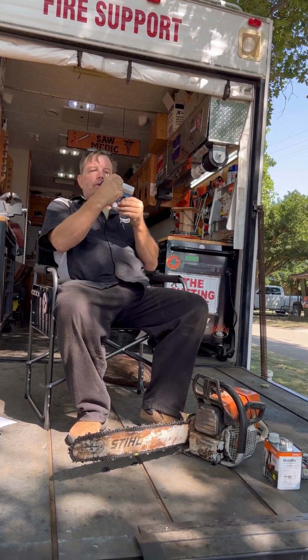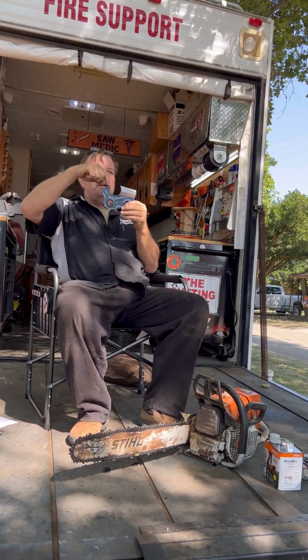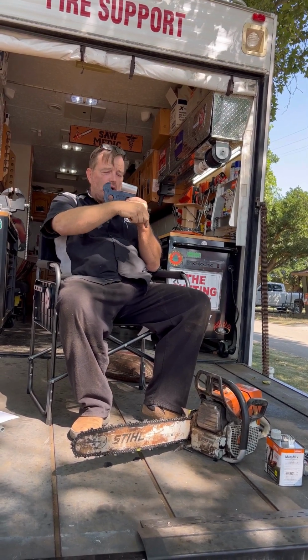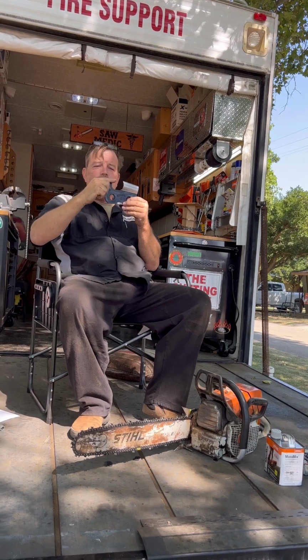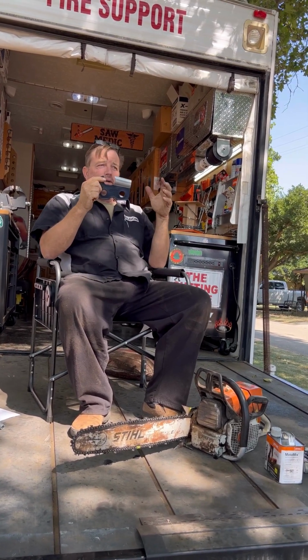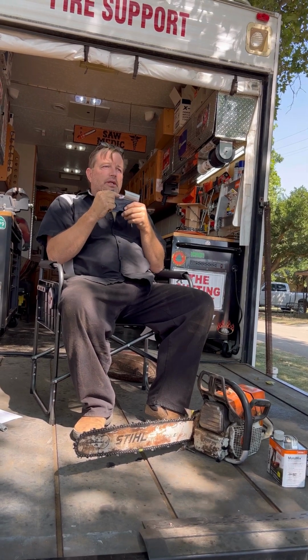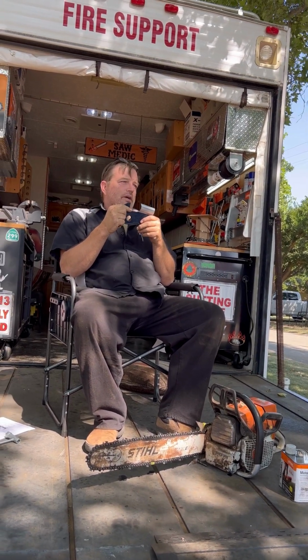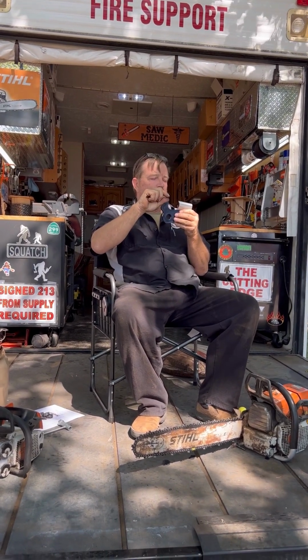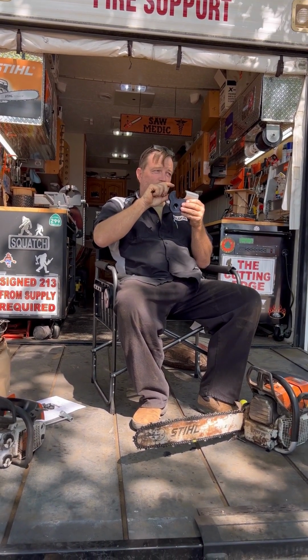And there's a mathematical gap between that height and this bump. So as I move back and it's lower, I got to bring this down. I got to cut some of this off to match that height. You see what I'm saying? Critical. So a faller's going to call that hungry. Is my saw hungry, or your saw's not hungry? Not hungry means this gap is too skinny, and too hungry means you got too much gap.